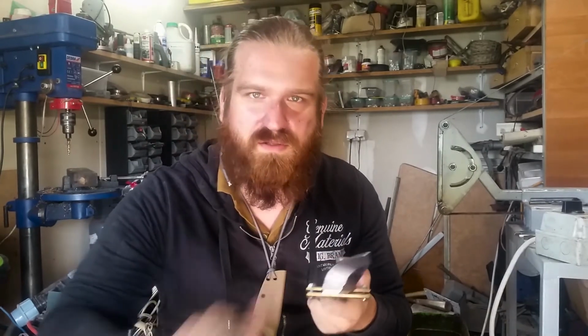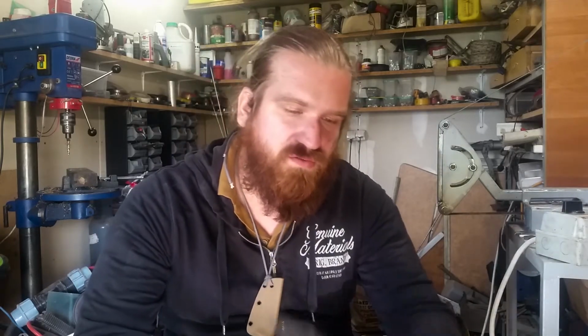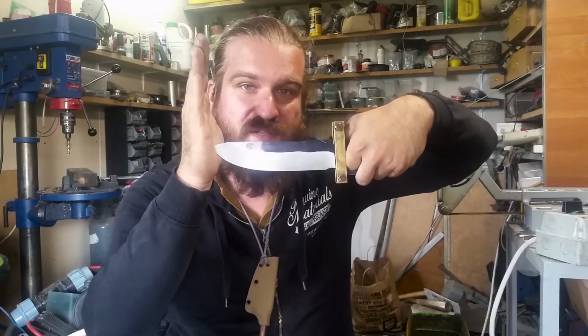So I will go on 80 grit to finish those, then I will take 120, and then I will have about 2 weeks of break from knife making as a whole, because I'm going to work while that happens. Oh, sorry, I just hit a gas bottle. So then 2 weeks of break from knife making. So in about 3 weeks, I think, I will have all the belts I need, because I want to go up to 500 grit before I heat treat this bad boy.